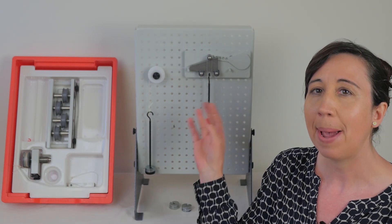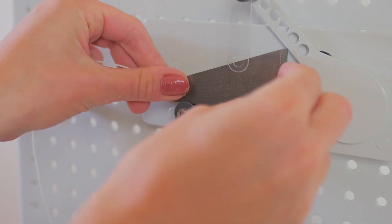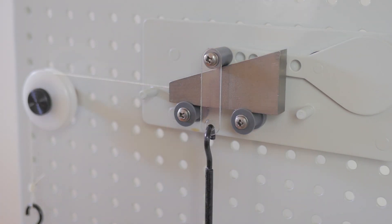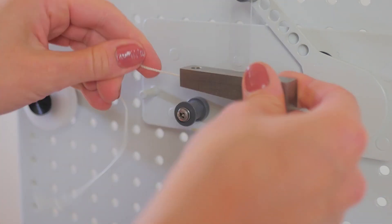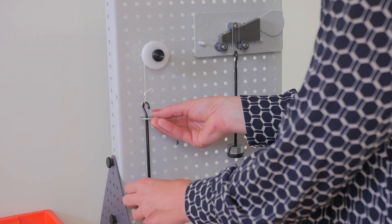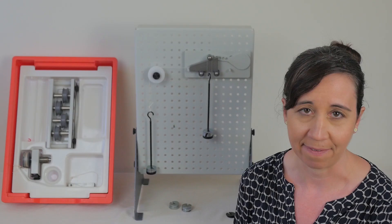Onto the wedge experiment. By mounting the wedge onto the work panel positioned in portrait, you start by fitting it with the largest angle — that's the 18.5 degrees. There are two wedges supplied, this one and a much smaller one at 4.75 degrees. Now you add weights to create the load and then slide the wedge to the right and carefully add effort until the wedge moves to the left. Now we record the effort value.